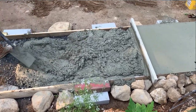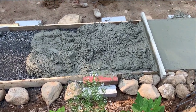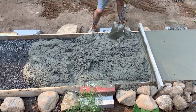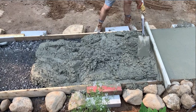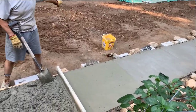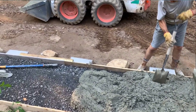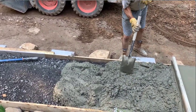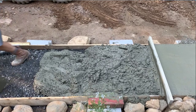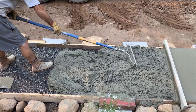Here you can see I'm shoveling in and trying to get a decent layout so the concrete is spaced evenly, so that when I go to screed it it's not going to be pushing too much material and it's not going to have too many low spots. It's kind of hard to push the screed along if it's built up way too high or too low. So you try to get it pretty close to the finished height, accomplished with a shovel and a rake.